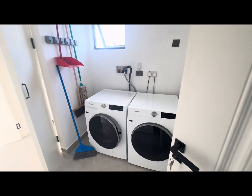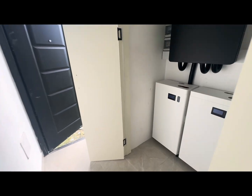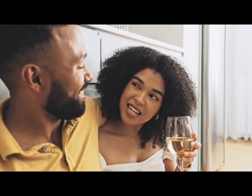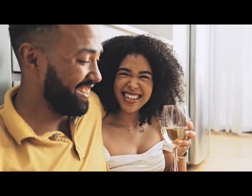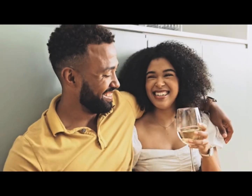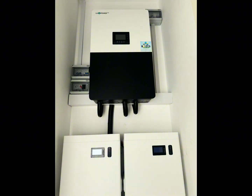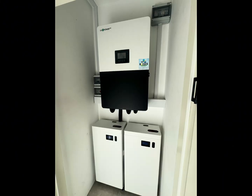Here's a bonus tip on this 16 kilowatt hybrid inverter. As mentioned earlier, this hybrid inverter can operate in hybrid mode and off-grid mode. In off-grid mode you can only get 12,000 watts out of this inverter, operating at around 50 amps output — that's when there is no JPS connected to the unit.